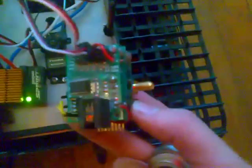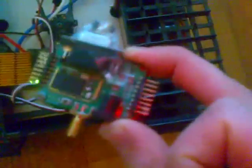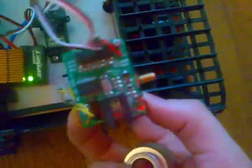This guy right here is actually 3 off-the-shelf pieces put together, and this is a Bluetooth serial servo controller. So this is a Bluetooth to serial adapter, and this is a Scott Edwards Electronics Mini SSC2 serial servo controller. This has 8 standard servo ports, and in the configuration I have right now, it actually gets powered by those ports from the electronic speed controller.